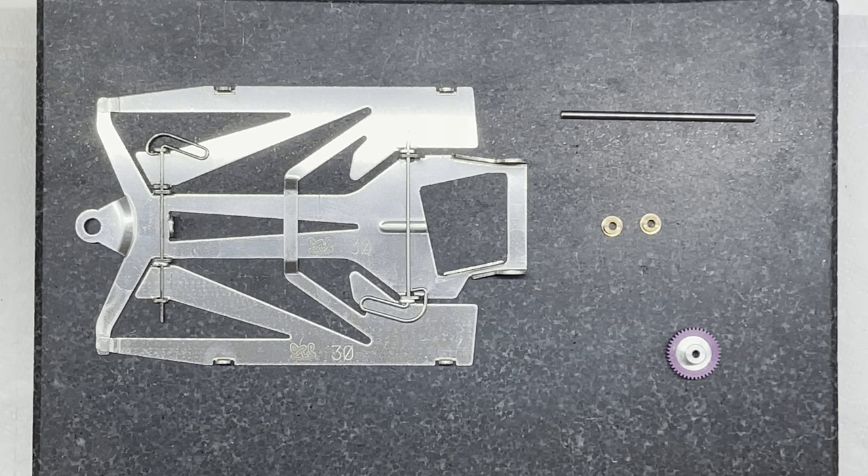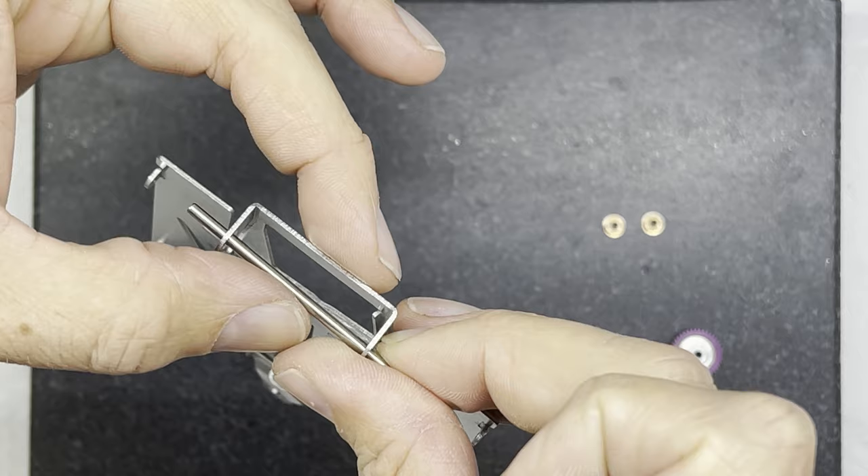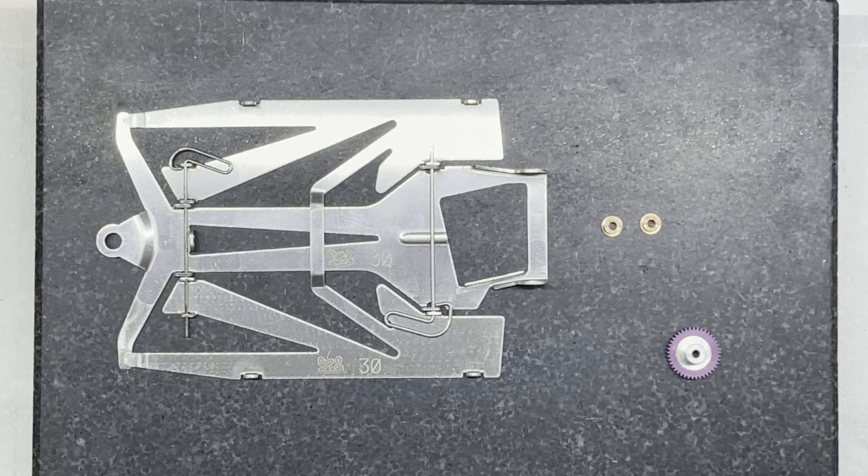In ISRA Racing there is an axle height rule. The axle height rule is measured from the bottom of the chassis when the axle is in to the top of the axle. ISRA states you have to use a 3/32 axle, but in your rules you might be allowed to use two millimetre axles. It's all about the rules you're going to race to - check them out properly before you start doing this task.